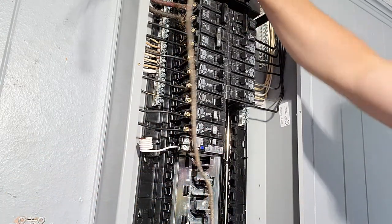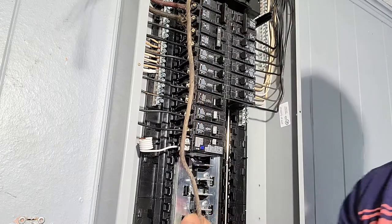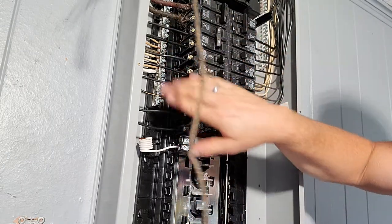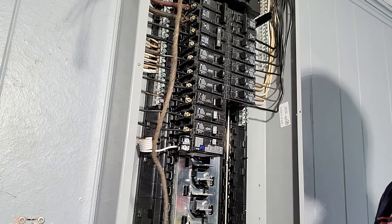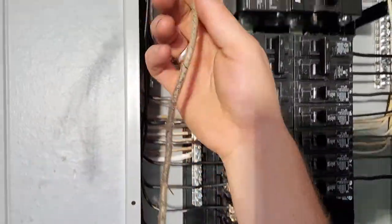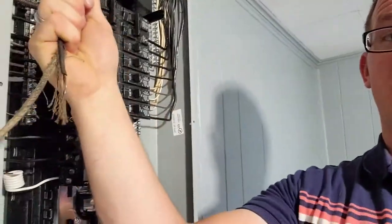You're going to take the neutral from that circuit. If you're installing one of these later, you have to find the neutral and pull it off the bus bar. You should never be working in an energized panel, and you have to make sure you're getting the right neutral from the right circuit. Sometimes it takes several minutes, because if you were to pull a neutral from another circuit, the breaker would trip, and if that breaker were sending power through when you pull it off, you could actually fry everything in between. So always make sure that you have the neutral and hot pair — trace it all the way up to the top and make sure you have the right pair.